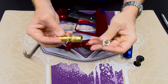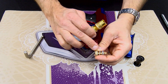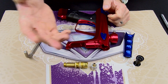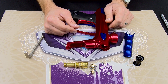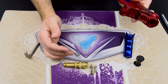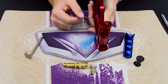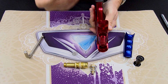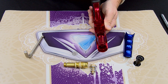Right there, you can pull out the regulator piston and spring. We have one O-ring on that regulator piston and one O-ring that sits down in this housing — those are the main two O-rings that require regular maintenance or servicing. In the main body itself, the only remaining item is a regulator filter that sits down in that body, and there's one O-ring housed down inside. It's not a dynamic O-ring, it's a static seal — it just sits in place, so it's not something you're typically going to have to get into for maintenance.